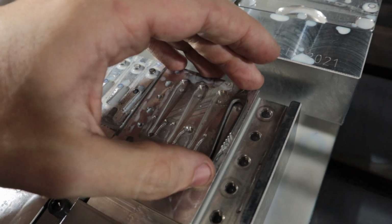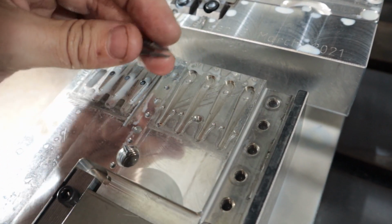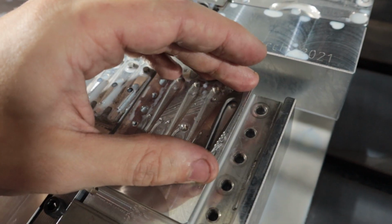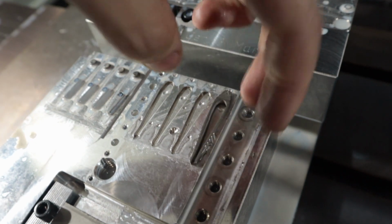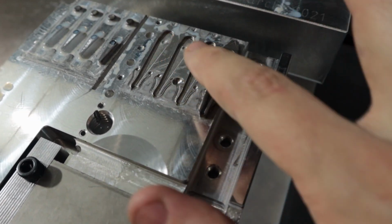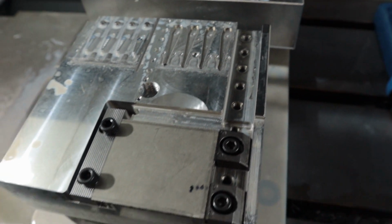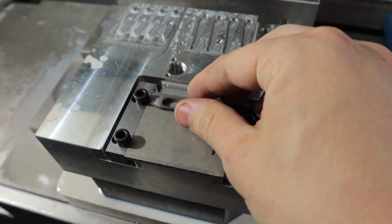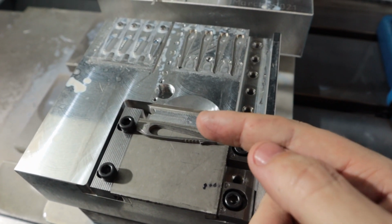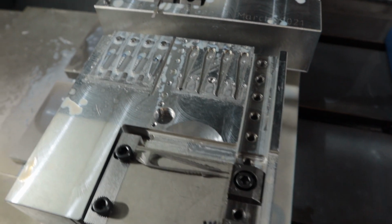So you can imagine they're sitting in the stock with pressure this way. The issue with machining the tweezers is they're a giant spring when you need to machine the inner pocket, and I have found this to be very tricky and very inconsistent. Originally, with the Talon grips pushing this way, I would fight to get the tweezers to be consistent as far as the pockets go. So what I ended up doing was changing to this. Now the tweezers sit in this direction with the Talon grips forcing pressure parallel to the jaws. And this is working much better.